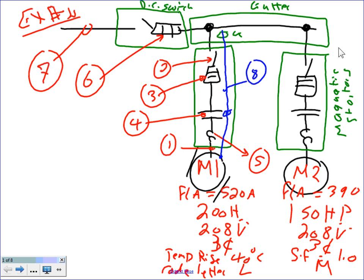Remember when we went to Boston Scientific, guys, they were showing us all these MCCs they have in the mechanical room. An MCC is a big box that inside the box you have a disconnect and a fuse or a circuit breaker, a contactor or a VFD, and an overload, all in one big bucket, they call it. We're going to do this later.